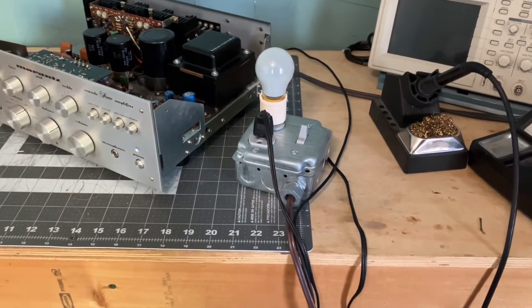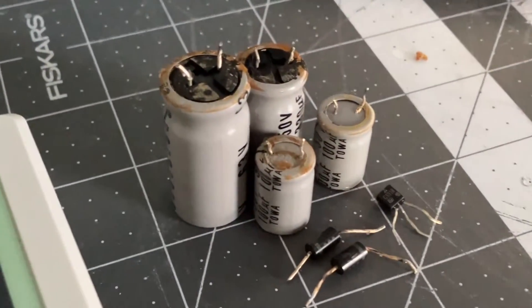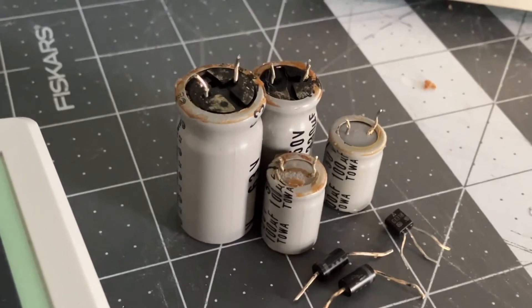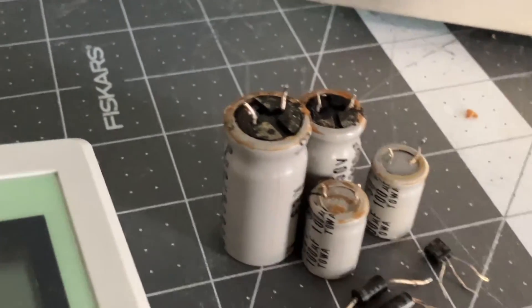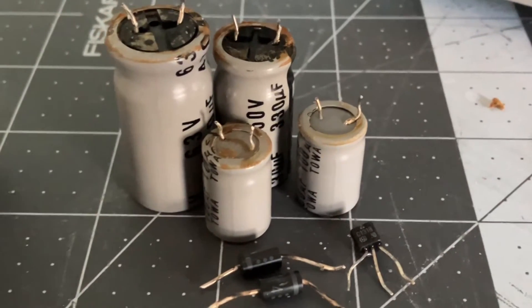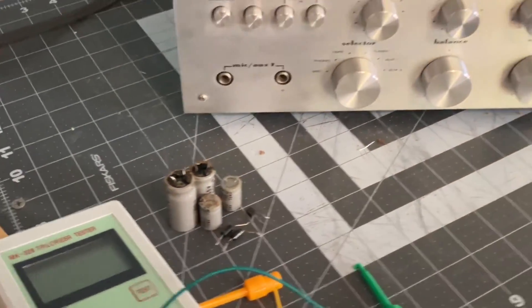I'm going to let this sit for about 15 minutes and come back to check it. Almost forgot — these capacitors were tested before replacement. The large can was 17% out of tolerance with ESR still good, so passable but getting towards end of life. The medium size can was done — over 22% out. The two smaller cans were out of tolerance by over 30%. As these cans wear out they start acting like resistors in the system.